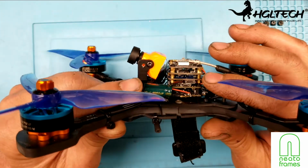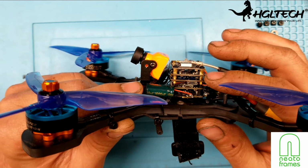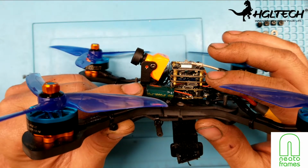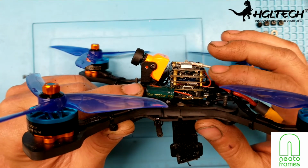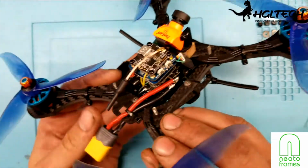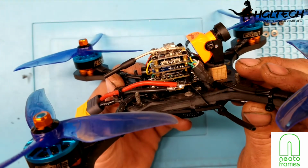If you see the little blue pad, I did an unboxing, and I kind of put this together, the RunCam Mini. There's a little pad that goes between the 2 boards. You want to keep that there. It's for heat distribution. It works as a thermal pad, kind of like a CPU in a computer to its heat sink. It's the same thing. They use the top board as a heat sink, and I think they use the SD card little metal clip there as kind of a heat sink as well.